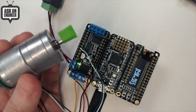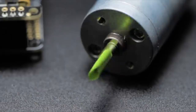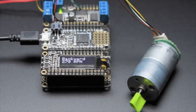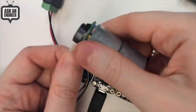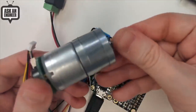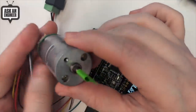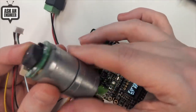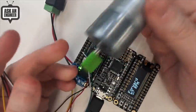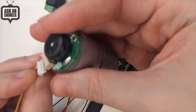If you have two motors, you can drive straight because you can measure speed. You can pop on a Particle and now you're transmitting the data or controlling it remotely. These are encoder motors — it's nice that the encoder is already on the back. Usually you have to add that on, or spend a lot more, but these are only about 12 to 13 dollars and basically come with everything ready to go. You can unplug the cable, mount the motor as desired, and reattach when ready. Someone asked if the gearbox can be removed from the DC motor with the magnetic encoder. It looks like it bolts on — this is clearly the motor and this is clearly the gearbox — so you could probably remove it. Most people don't want an ungeared motor, and the 1-to-20 gearing is a pretty good amount. They're not that expensive, so it's worth experimenting. If people like these, I'll stock more.